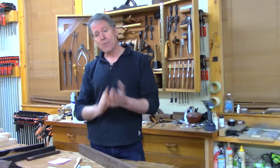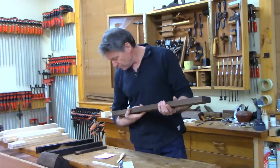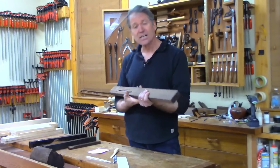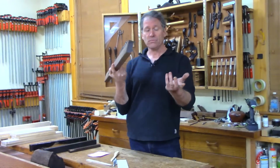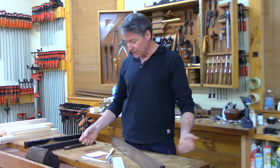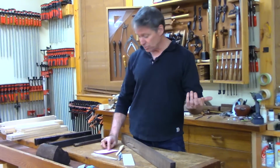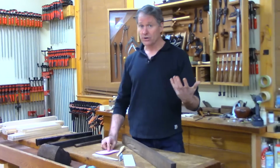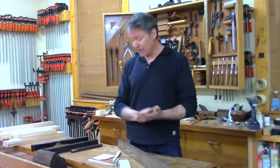So in pressing that ball into cocobolo, it takes, let's see, 2,950 pounds pressure. So that's pretty hard. Just to give you a reference, some of the more common woods that we know, like walnut, is 1,000 pounds pressure. Cherry is 950. Ash is harder, it's 1,320. And white oak is 1,360 pounds pressure.